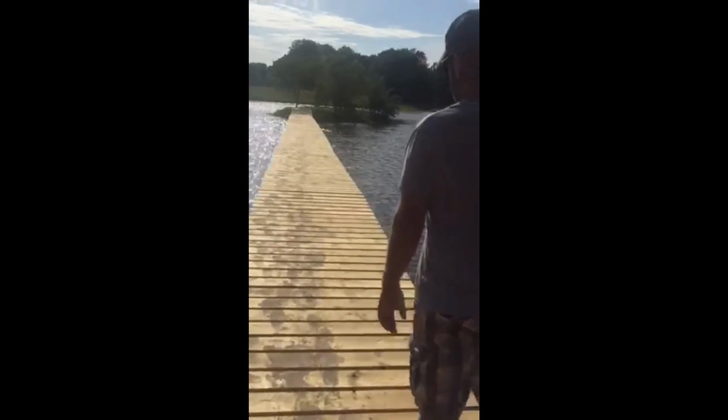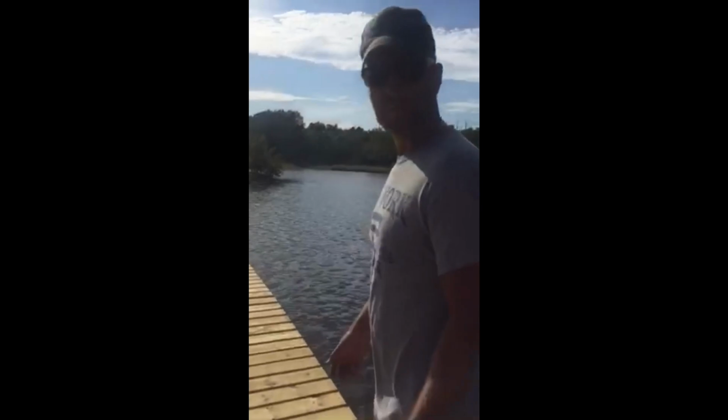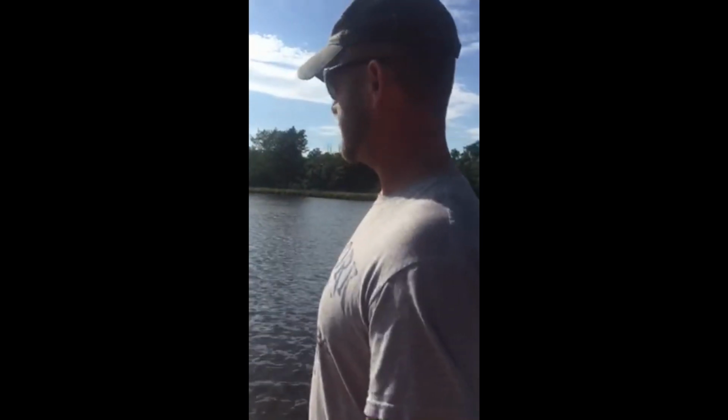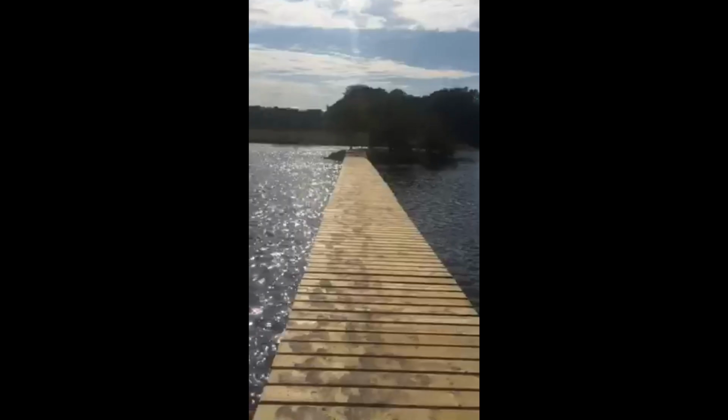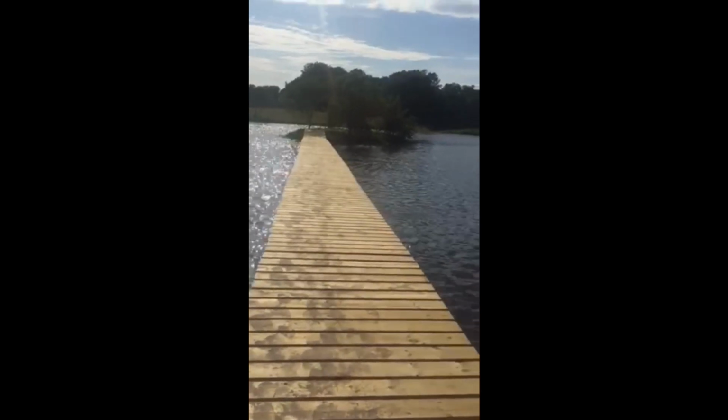The bridge floats well with 2 people on it. I think it's going to be able to hold up a lawnmower or a 4-wheeler or something like that pretty easy, without using posts and sinking them down into the pond. We were able to save quite a bit of money in lumber. We didn't have to use 2x8s on the sides to carry the load of the weight. Since it's floating, the load pressure wasn't the same, so 2x6s are plenty strong enough for the frame of it.